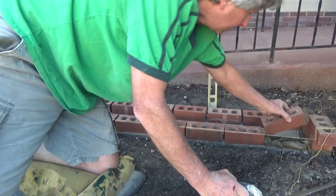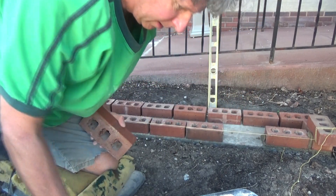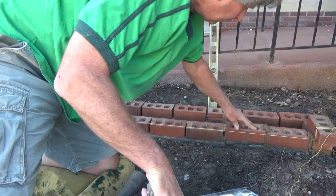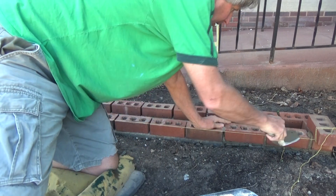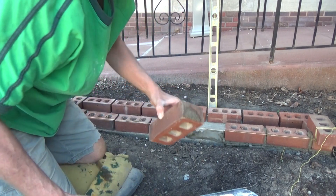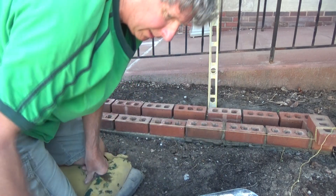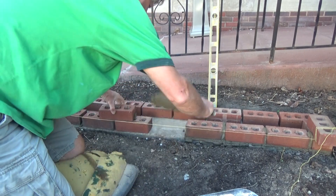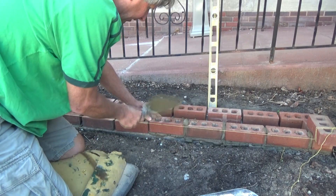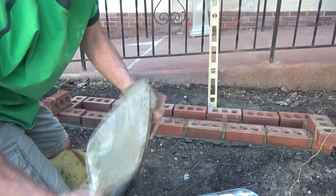People ask me, Mike, what cement are you using? Well, you're not going to like the answer. I usually use S mortar, but for a brick like this I use Portland. You might say, 'Oh, you can't use Portland on brick.' Well, I live in Northeastern Pennsylvania. The snow will get in here. It's 25 degrees at night and during the day it's 40, so it's freeze-thaw, freeze-thaw, freeze-thaw. And guess what happens with freeze-thaw? If it was just lime, it all falls apart. How do I know that? I've been doing this since the 1960s. I know what lasts in my area and what doesn't.